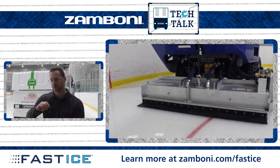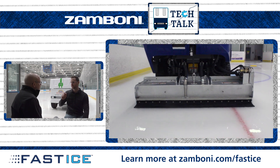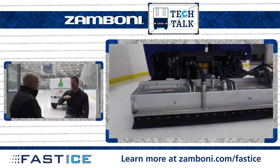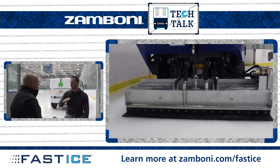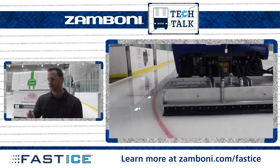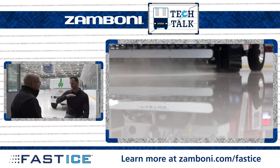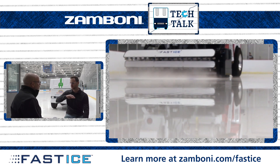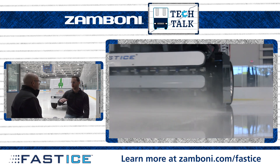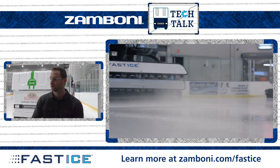That slush will be cool and that towel is hot. As that towel goes over it, it'll pull a tiny little bit of slush out of some of those skate grooves. We've all skated on it — sometimes if you get into heavy spots you'll feel those grooves where they're not quite filled in. That's from the towel dragging across and pulling out a little bit of the slush. It still puts down fresh water and fills it most of the way back up. With Fast Ice you don't have that — you have a perfectly smooth ice surface with nothing dragging slush out of those skate grooves. It's filling those skate grooves and that water self-levels and freezes up real quick.